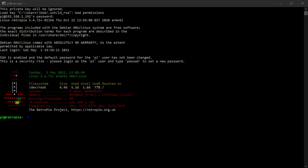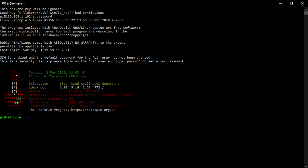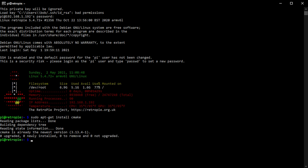Connected back to the Raspberry Pi over SSH and ready to go. The first command is to install the CMake application, which allows us to create makefiles for compiling. It's probably already installed, but it doesn't hurt to try reinstalling — it will update if a new version is available. Mine is already up to date.